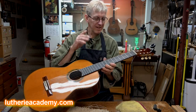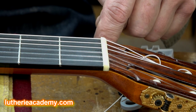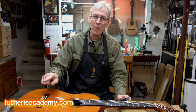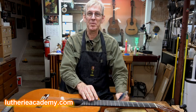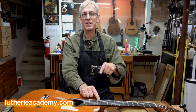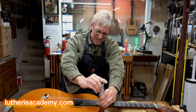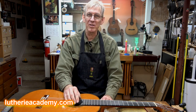Well folks, I finished up the fret work and put the strings on. Usually what happens is you have to lower the nut because you took a considerable amount of ebony off this end of the fretboard. I had to lower the nut a good two, two and a quarter millimeters. I checked with my string height gauge from LMI — I'm coming in at 3.23mm and I like to see about 3.5mm. The action when it came in was closer to 4.5 or 5mm. Over here on the treble side, I like to see 2.5mm, and right now I'm coming in at 2.43 to 2.44mm — so I may raise it just a little bit or even just live with that slightly lower action.